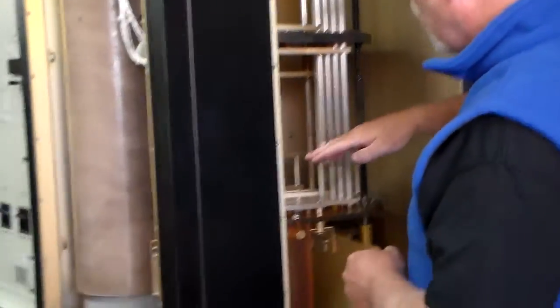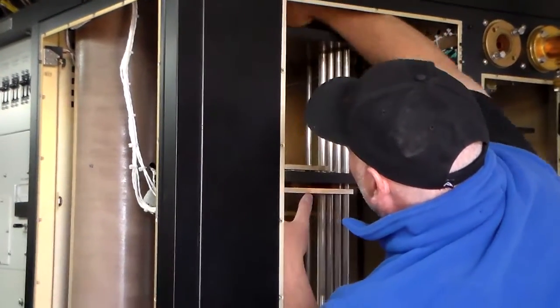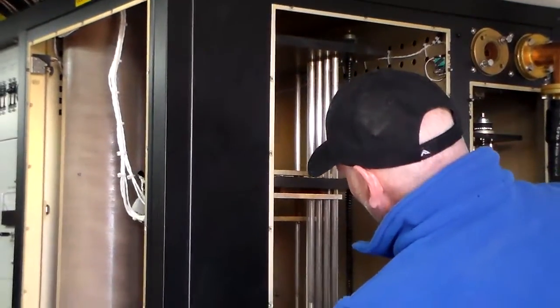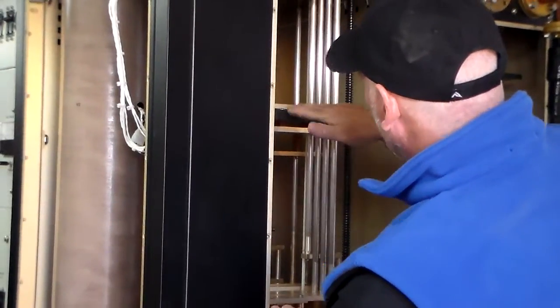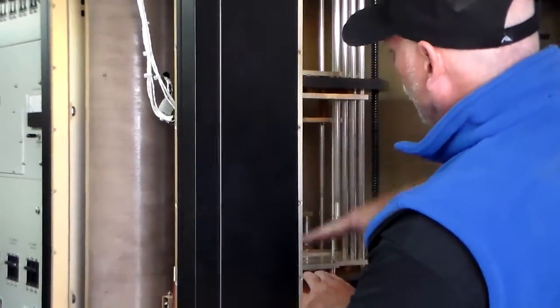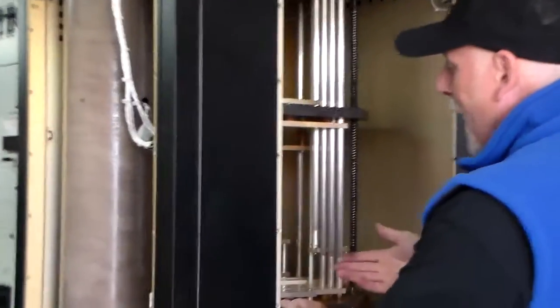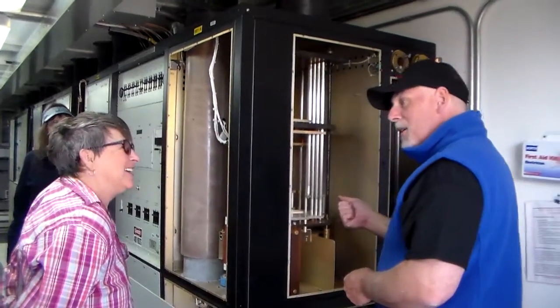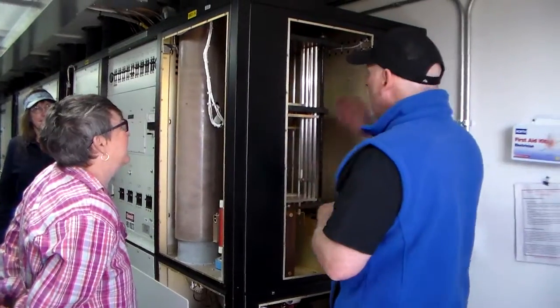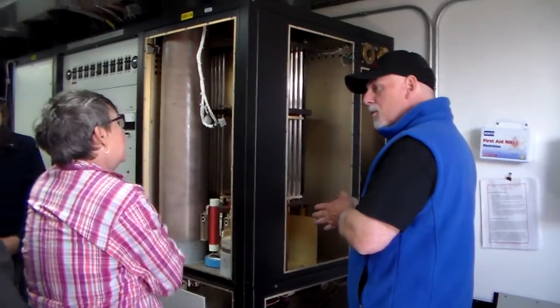Now what's moving up and down? I see, there's a screw thing. Yeah - so I have a motor which is driving this lead screw here, and all of this needs to be level and lubricated so that it can flow smoothly up and down. That's why you come oil it. Not only that, but the old oil has to be cleaned off so it's not all gummed up. We put new oil on it, run it up and down, make sure the motor is doing what it's supposed to do.